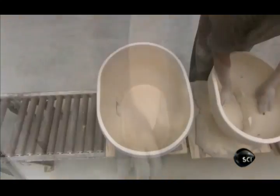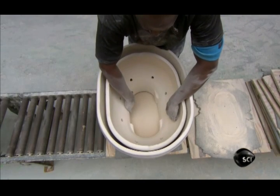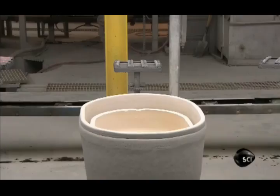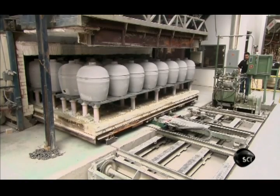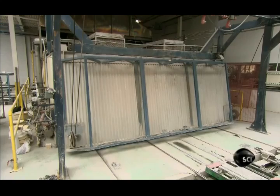Workers then temporarily assemble the grill parts for firing. They place the firebox inside the base, the base plate at the bottom of the firebox, and the dome on top of the base. They fire the grills in a huge kiln. Over 24 hours, they gradually increase the temperature to more than 1300 degrees Celsius.